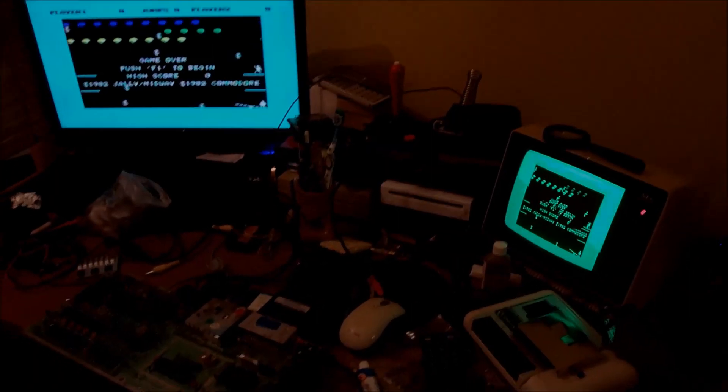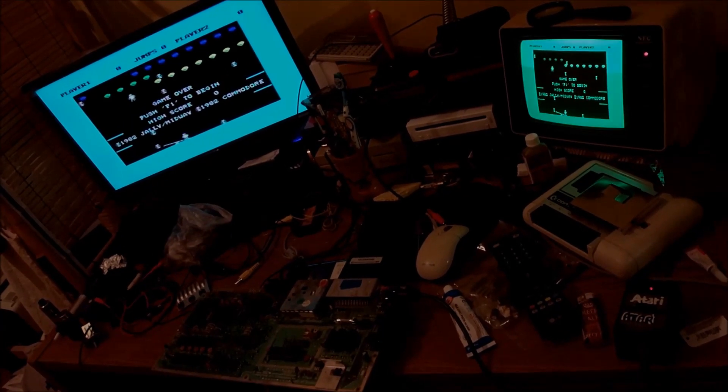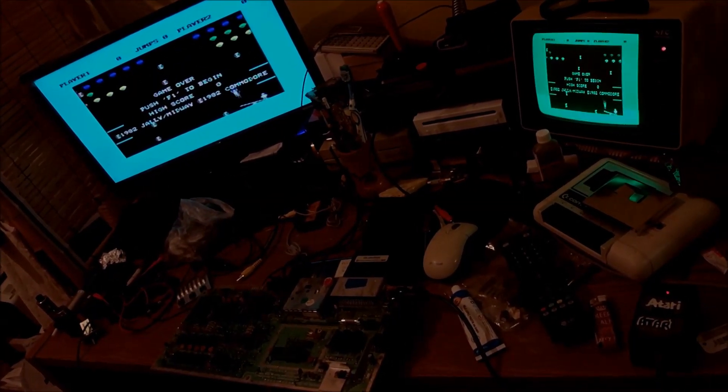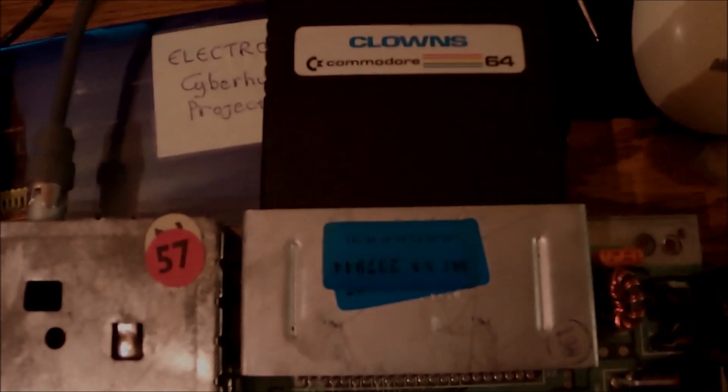At the same time we are using the composite and TV output just to check that the VIC-II chip is working. Don't worry about not having the heatsink on — I'm going to leave it running for 2-3 minutes maximum for testing purposes, and then power it off.